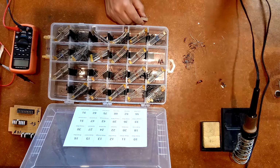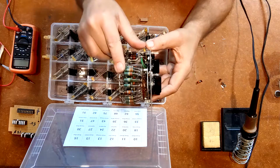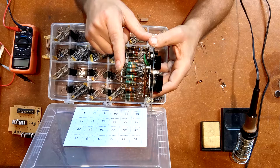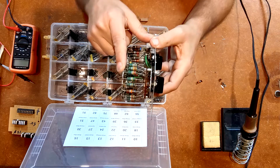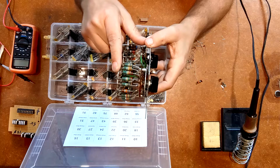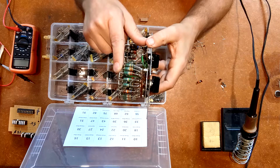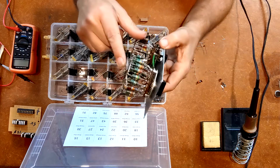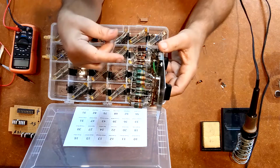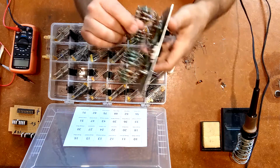Resistors, for the uninitiated, have wattage ratings. You have to realize what a resistor is actually doing is dissipating energy as heat. It's converting energy into heat. And so the bigger the resistor, the more heat it can dissipate. The more current can be flowing through that resistor, the more it can resist. So ultimately they have a rating in terms of how many ohms of resistance, but they also have to have a power rating.